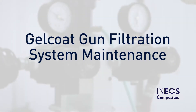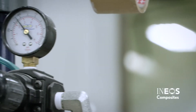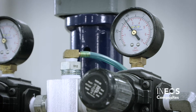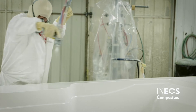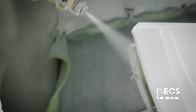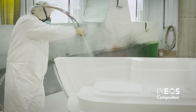The application of the Gel Coat will be altered if the Gel Coat gun is not properly maintained. Therefore, before spraying a part, check to make sure that the water traps have been drained. Use an air drying system to remove oil or water contamination. Oil and water can cause defects in the Gel Coat — the most common are dimples or fish eyes. Also, monitor the water traps on the spray gun; they should be drained daily. Verify that the traps have been drained before beginning to spray.